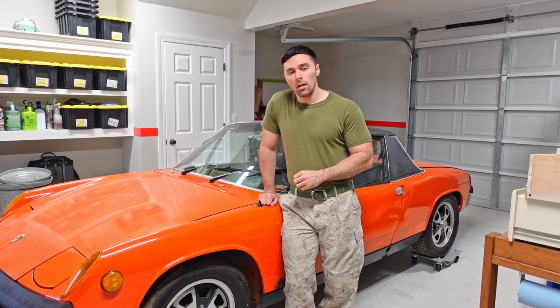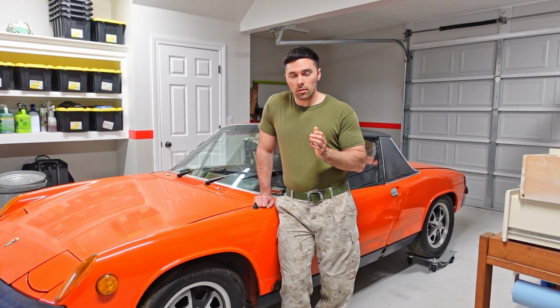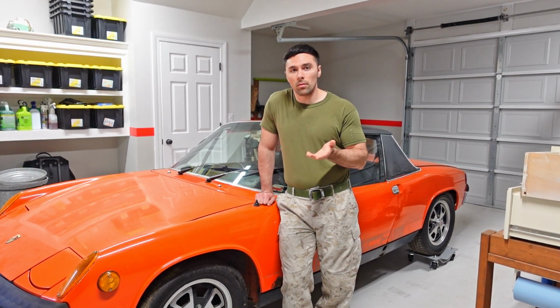Alright, so the winch worked. We've got the car up here in the garage now. Now, if you notice in the video, I had the winch sitting on a couple pieces of wood. That was there not for structural support. It was literally just to lift the winch up a couple of inches so that the cable would not hit the top edge of the trailer, which was about 6 inches tall or so. We wanted a clear path so there wouldn't be any rub and wear on the cable itself.